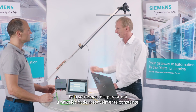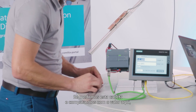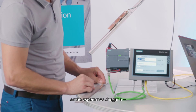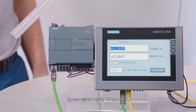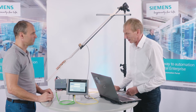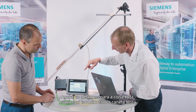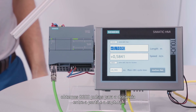If we drop it, it travels through at a fairly constant speed. Now, if we measure this pen and compare it with the value here, we hopefully come up with almost exactly 17 centimeters — 16.9. Now, if we look at the whole thing, with the slow pen we get 8,600 pulses for the distance between gate and capture, and I noticed that we ought to do it more quickly.